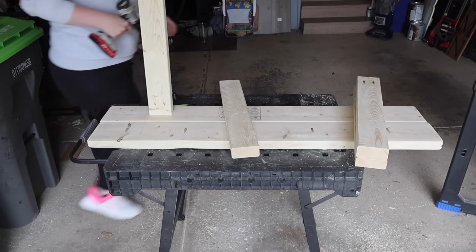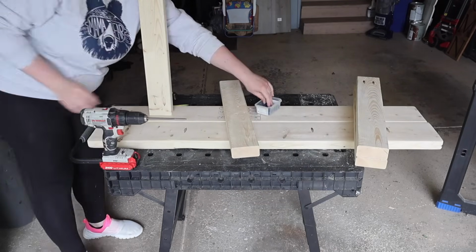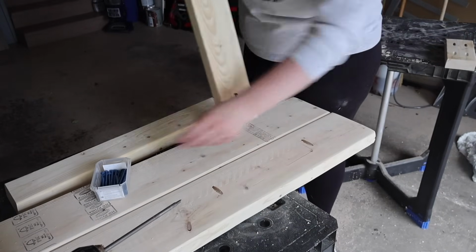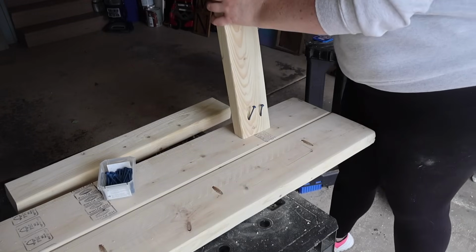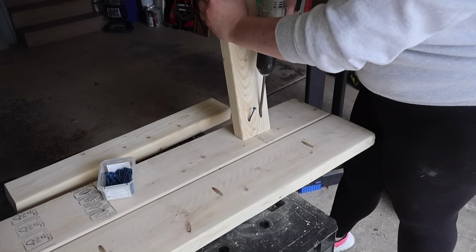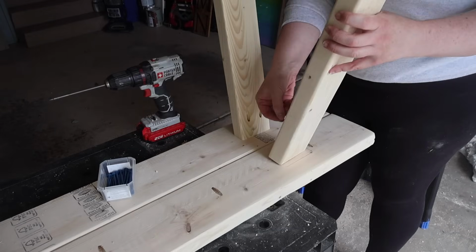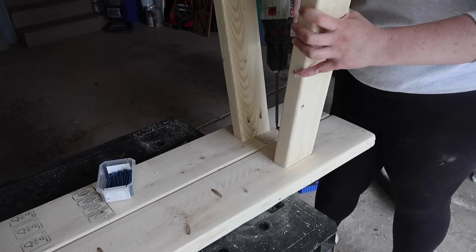And I did one side, put both of them in, did the other side, and then I did the other 2 legs. Now, again, if you don't want to do the pocket holes, you can line these up and go straight through the top of the seat, especially if you've got like gold or darker screws, you can do that. And especially if you're adding a blanket or something, nobody's gonna know. So you don't have to get a Kreg jig for this, but I do like it.